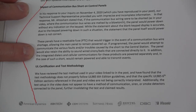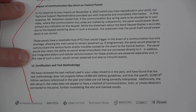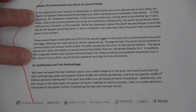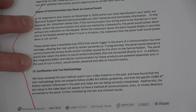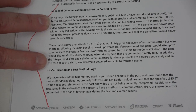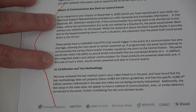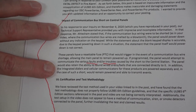The panel would also retain the ability to sound wired siren bells connected directly to it. In addition, the integrated dialers and cellular communicators for these products are powered separately and, in the case of such a short, remain powered and able to transmit events. In accordance with the plain language of UL-985 6th edition and NFPA 72, the keypads cannot power down — they must remain functional. With regards to the panel remaining powered, if the keypads go out it is meaningless because the sirens do not sound during the fire alarm, the keypads do not sound during the fire alarm, and the central station does not receive fire alarm signals so that operators can immediately notify the fire department to respond to the fire emergency at the protected premises. Johnson Controls admits that all that's sent is faults and troubles. A fault and trouble condition is not a fire alarm signal.